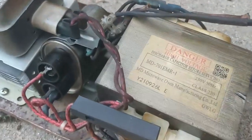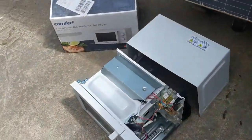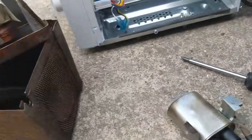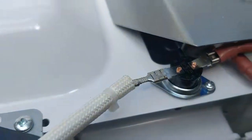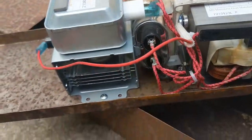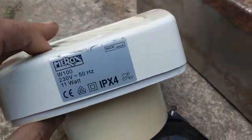That's 60 euro gone. Luckily I already bought a used one, a bit cheaper. The 300 watt really needs a big blower. My solar cooling box is nearly finished, but I've continued taking it apart and installing a second set. I've kept the temperature switch and added a second switch where it should be the hottest area, because airflow is around it with an outlet here. Both switches are in series, so if one of them fails the system shuts off.